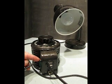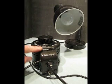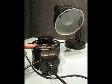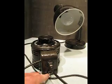It's been totally rewired with a new drop-in cord, and it's got an on/off switch, just like every other variac. It's got a new paint job all the way down to the bare metal. It's been cleaned up and put back together. Also put a three-prong plug, and it's grounded right here with a green wire.